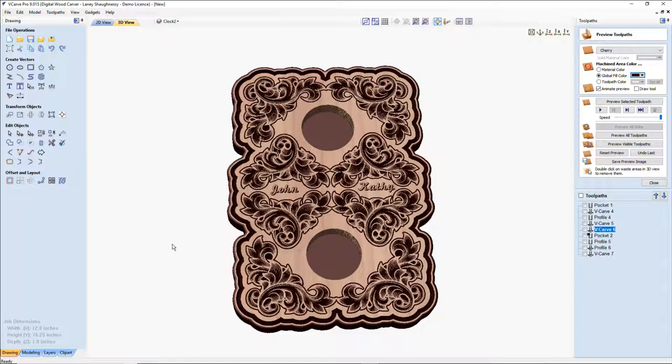Are you talking about the tapered ball nose 16th inch bit? Or are you talking about the actual 16th inch end mill, the flat 16th inch small end mill? Because the 16th inch end mill would be used for small pocket cuts, getting into small areas and things. The ball nose bit, the 16th inch ball nose, is typically left for 3D model cutting, getting into those detail areas with that smaller tipped bit.